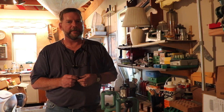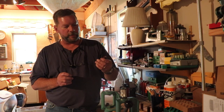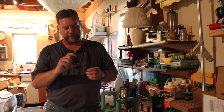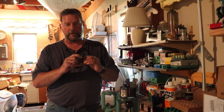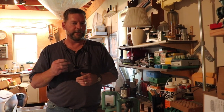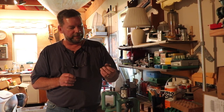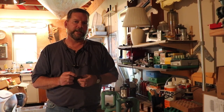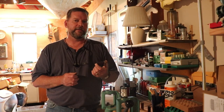The walls of a paper case are much thicker than having no case at all as with a muzzleloading shotgun, so you'll need a slightly smaller wad for paper cases. They're a lot of fun though — you can load them any way you want, varying the powder charge. The key is to fill the case and find a formula of over-powder wad, cushion wad, and shot that leaves enough room for the crimp without leaving too much empty space. It just takes a little experimentation. They're easy to load, fun to shoot, and we'll see you at the range next time on Frontier Western Heritage shooting 12 gauge out of a WW Greener.